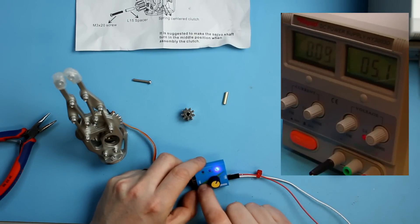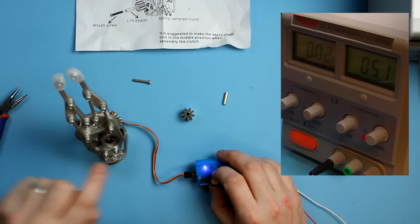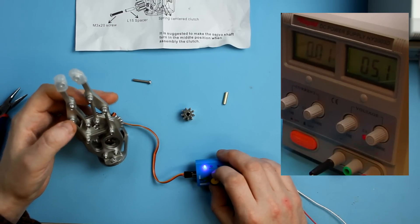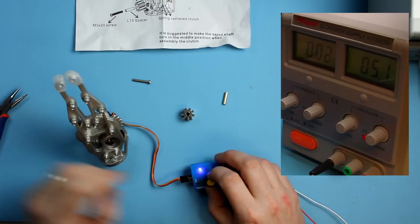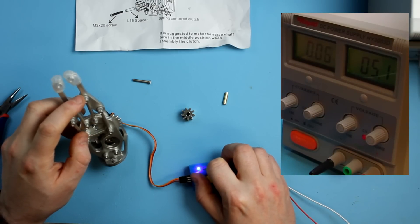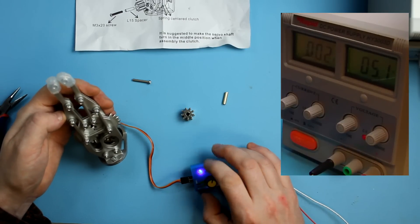What I'm going to do is set the servo up so that when I mesh these two gear cogs together, one extreme of movement matches the frog legs closed and the other extreme matches frog legs open. I think that position is fully open and that one is fully closed — so that's how I'm going to do it.